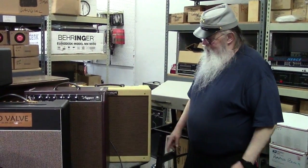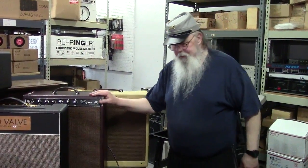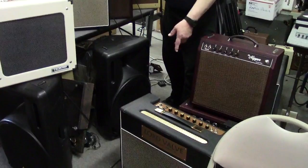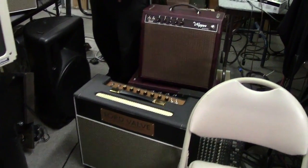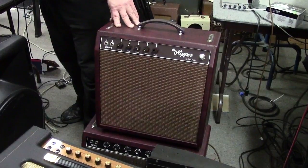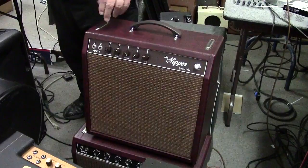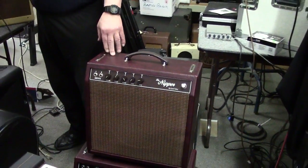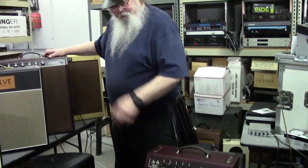It's a really great sounding amp. Every jazz guy that plays it wants it until they find out how much it costs. Down here is the 12-inch Napper, 24 watts with a 12-inch speaker — that's the most popular one. This is the little Nipper. It originally started out to be the same size as a Champ — that is a Vibro Champ chassis — but I decided to make it a little taller so I could put a 10-inch speaker in it. It's about 16 watts, same preamp as the two Nappers, except no reverb.